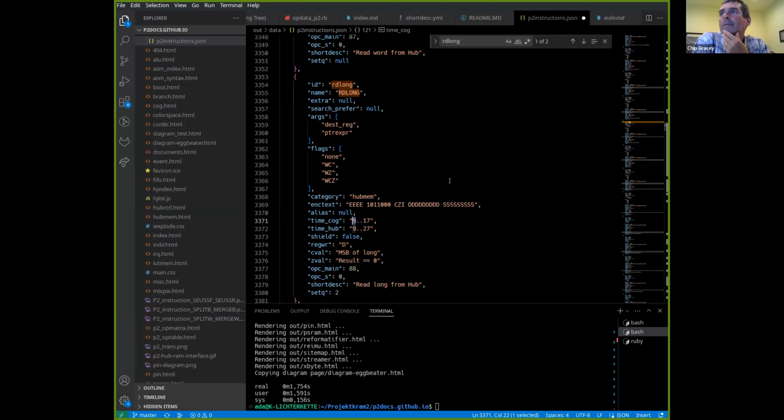Right. I think you could probably use the FIFO to sort of prefetch it. I haven't really looked into how long the FIFO really needs to do the delayless reload. Because in some cases, I think it's possible that you can only spend 4 cycles on a read, which is maybe better in some cases, but you have to know the address in advance.